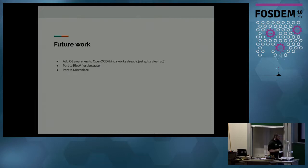Well, the idle task is literally one line of code in that case, and that's ASM wait for interrupt. And then you go to sleep and wait for an interrupt, because that's the only thing that could make any other task run, right? A change in condition that triggers an exception. So that is not entirely true, though, because the microcontroller might need to take a certain amount of time to go to sleep and wake up, so going to sleep might not actually be the right decision depending on how long you're going to wait in the idle task. So there's also a bit more clever way of doing that in Chromium-EC, but I haven't investigated how exactly that works because my device is plugged into the wall, so I don't actually care that much about power. Yes?